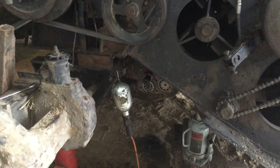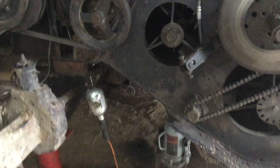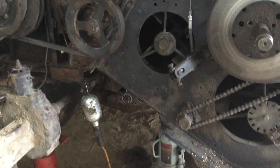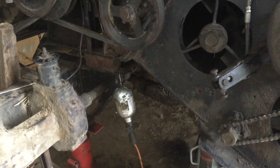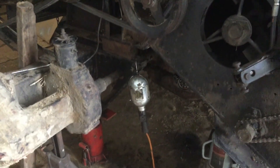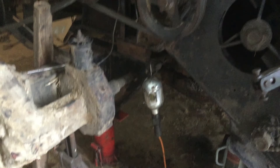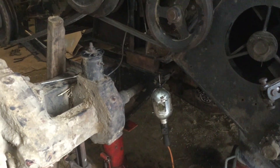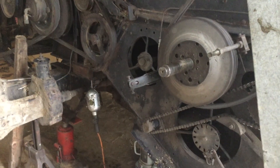The second time the clutch was stuck all the way down. I crawled underneath and found the inspection plate — on an E-combine that stuff comes right out, but not on the F's. I took the inspection plate off and saw that the fingers were worn down on the bearing holder and the spring was missing. On top of that, the clutch shaft that comes out in this area — which has the variable speed pulley — is worn out, along with the great big spring apparatus and the carrier. So we hadn't done a thorough enough examination when we bought it.